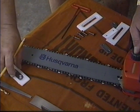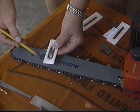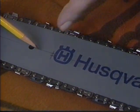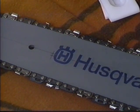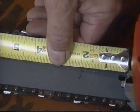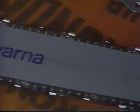From here, going back to the guide assemblies for a minute, what we want to now do is remember that the spacing is going to be 3/4 of an inch outboard of both of those marks that we just put on, and then we're going to have to be putting a mark that runs top to bottom. So we'll first measure 3/4 outside of those marks. So these are our 2 new marks.